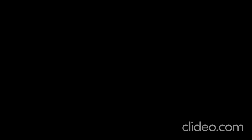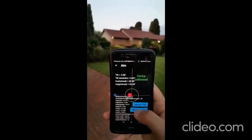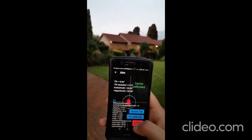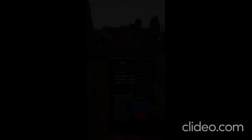After selecting the link, I navigated to the aim screen. I first recalibrated the device and then performed the alignment by ensuring that the blue dot representing the target antenna is positioned within the specified threshold zone, indicated by the circle in the middle of the screen. This process will then simply be repeated at the other end of the link.